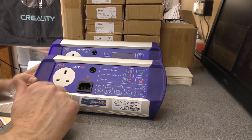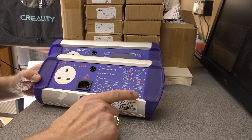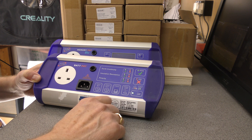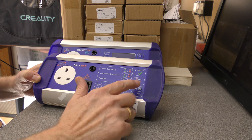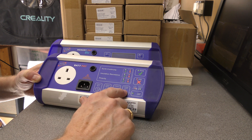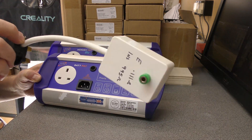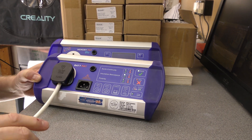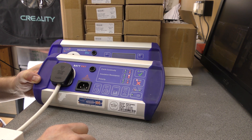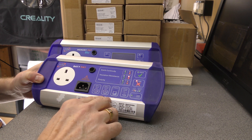This is a basic pass or fail system. You have got Class 1 metal, Class 1 plastic, Class 2 double insulated, and you have got power cord testing. You can also trigger the long lead feature to allow for that, and you basically get a pass or fail. If we were doing a Class 2 piece of equipment plugged in here, we would just press that and it will pass. If I plug in this calibration unit and do that again, you will see it will fail this time - there we go. It's a very simple pass or fail, and that is the one we use every day.